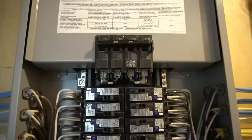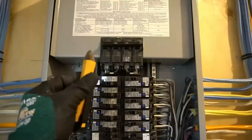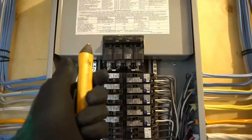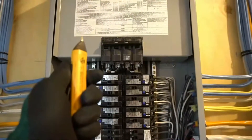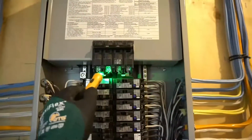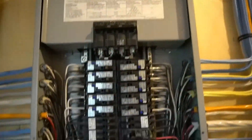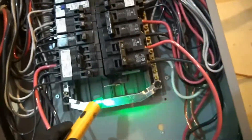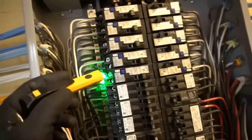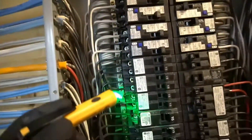You should wear gloves, just in case. I'm working on this panel live. Here I have a volt tester. I will show you the parts that you should definitely not touch while working live. Even though you have gloves on, it still can be very dangerous and you can die. So here are the four terminals you definitely do not want to touch with your bare hands. Those terminals are connected to this bus bar — that's also live and dangerous. And also these screws, you should definitely not touch when working live.